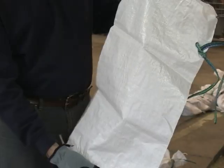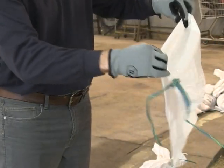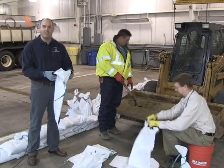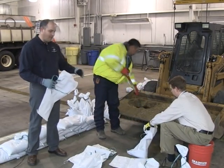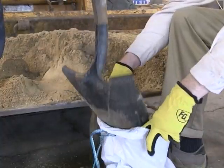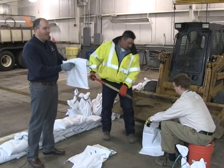Sandbags generally come in a polyethylene shape; they have ties on top. They're called sandbags because they get filled with sand, but any material can be used — dirt, clay — though sand is generally the easiest to work with and the easiest to shovel. When full to the top, a sandbag can weigh up to 70 pounds and doesn't compact well in the wall, so you only want to fill it halfway to two-thirds.